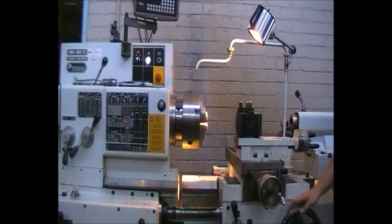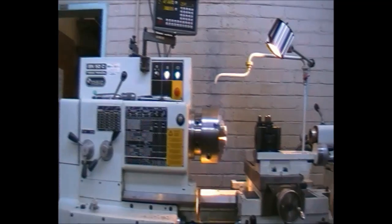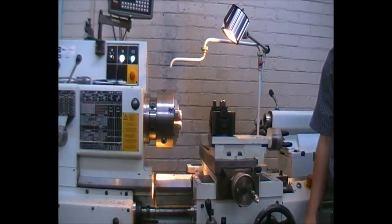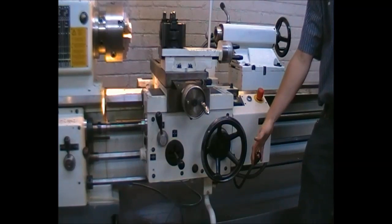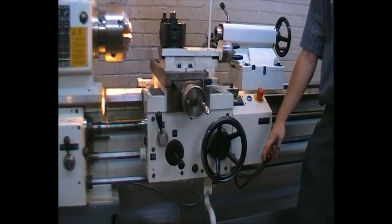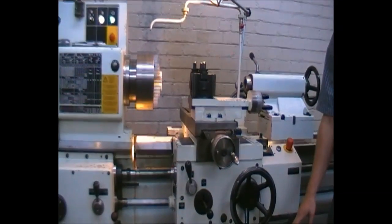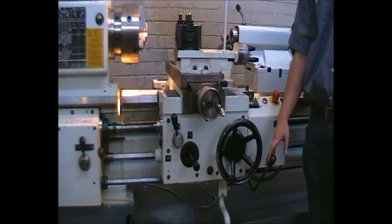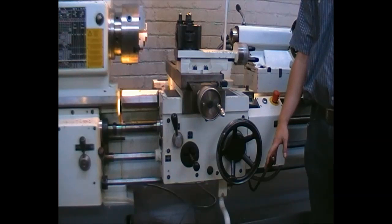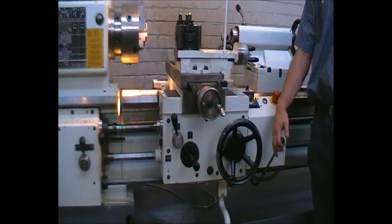The machine, once we have turned it on, activates the spindle in the correct rotation turning towards you. This lever on your right-hand side is pushed to the side and downwards. For 99% of all operations, that is the rotation you will use. Later on, if necessary, an instructor will tell you how to cut thread — then only will you push it to the side and upwards. This is not normally used by students.